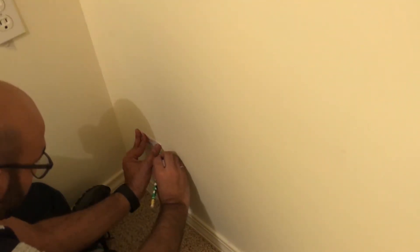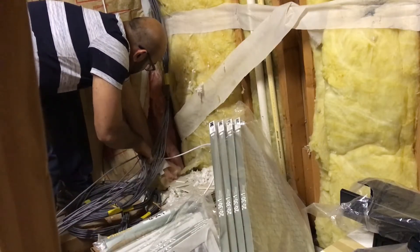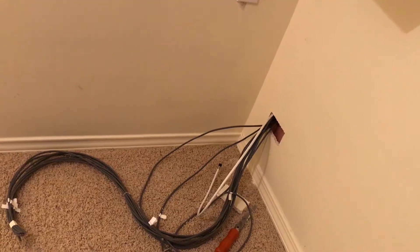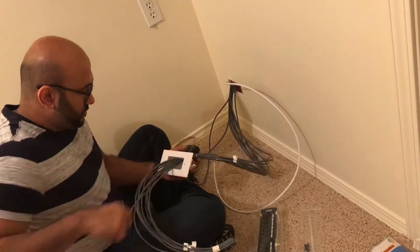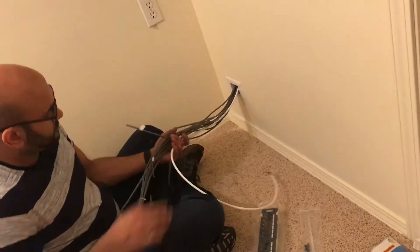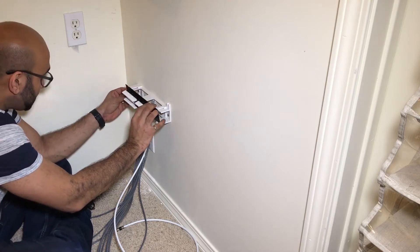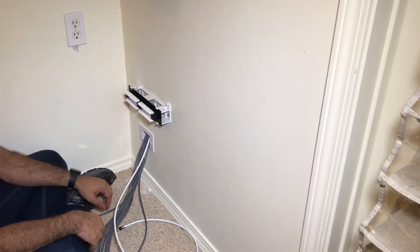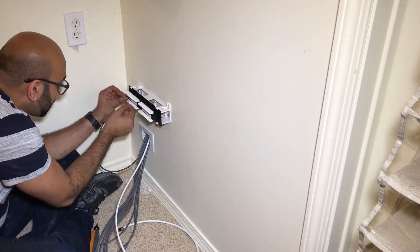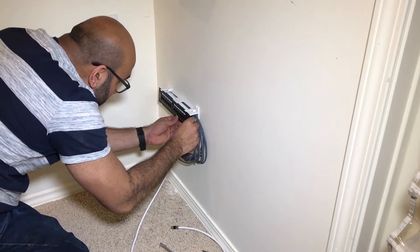Then I started making the hole on the drywall to bring in the cables. This process is very similar to what I had to do for the TV mounting — first use a template to draw it out, then cut the drywall, then start feeding the cables. I also had to run a coax cable from the attic because that's what my ISP uses for the modem. Now that I have all the cables run through the wall, it was time to install a wall plate so it looks a little bit organized. It was now time to punch in the other end of these cables into another patch panel going into this room. I realized that if I just put the patch panel backwards onto the mounting bracket, it was a lot easier to punch in the cables. This time around it felt a lot more comfortable simply because I was in a room rather than an attic and also because I flipped the patch panel backwards. After I had everything punched in, it was time to flip it back to the normal side and put it back onto the bracket.